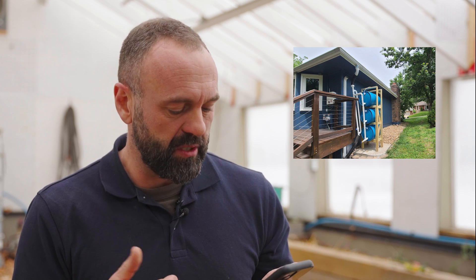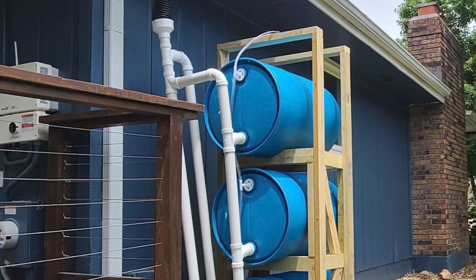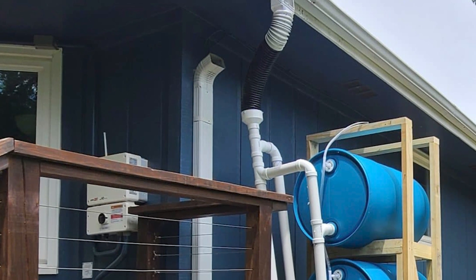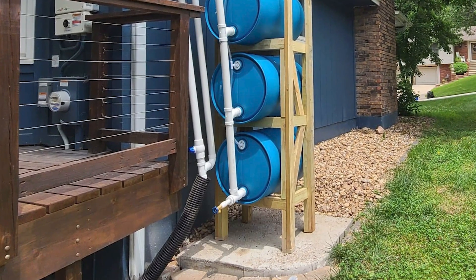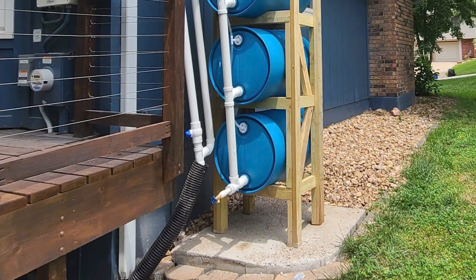The things that stand out in this first picture is that the plumbing is going to be really expensive. By the time you add up all the plumbing fittings, all the wood, and all the time you've put in to build this, you might as well just buy a proper rainwater harvesting tank. Water is super heavy — if this thing ever tips over, that's 600 kilograms or almost 1,400 pounds. It could literally go through the wall of your house. Also, I don't love how they've taken the water from the gutter down into the tanks with all these weeping tiles — those fittings look like they could fall off at any moment. One of the worst things you can do to a house is put water around the foundation; it creates foundation issues.